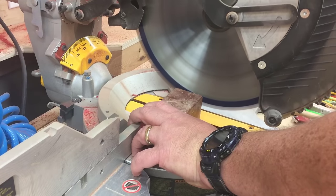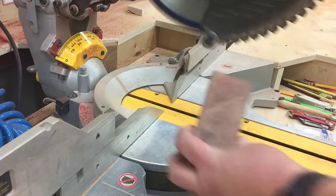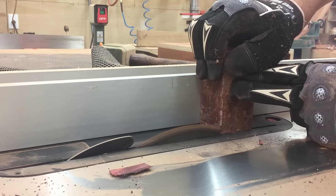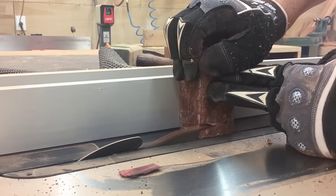The red heart for the head I bought from Rockler. It was just about right, and I only had to trim the end. I set the bevel of the saw at 15 degrees and cut the corners off the ends. This gives it the characteristic taper of Thor's hammer.